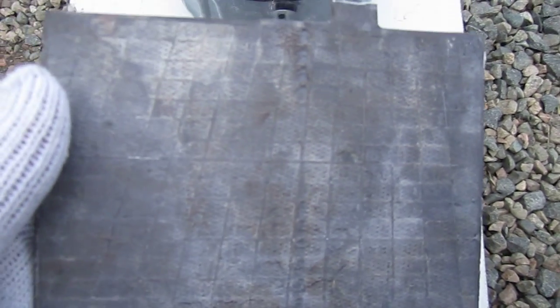Here's the one negative plate. You can see it's a light gray color, and if you really look good, you can actually see the grid of the lead itself. Inside that grid — and what I mean by grid is if you look very carefully, you can see them little squares. Well, in them little squares, that's actually packed paste — a lead paste that's packed in each and every little square you can see there on that grid.